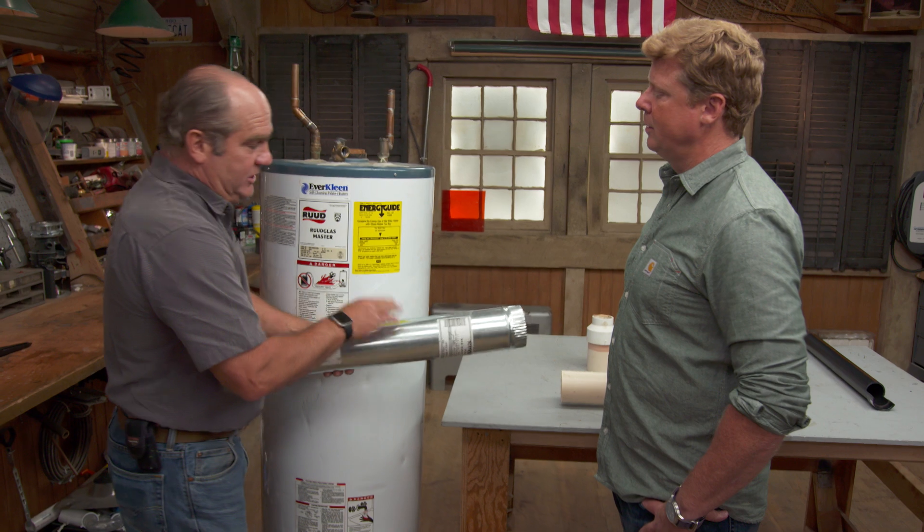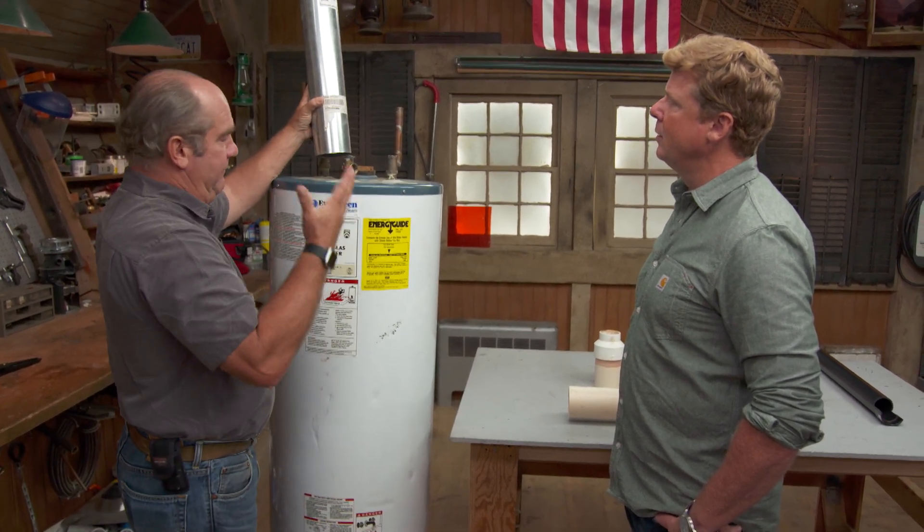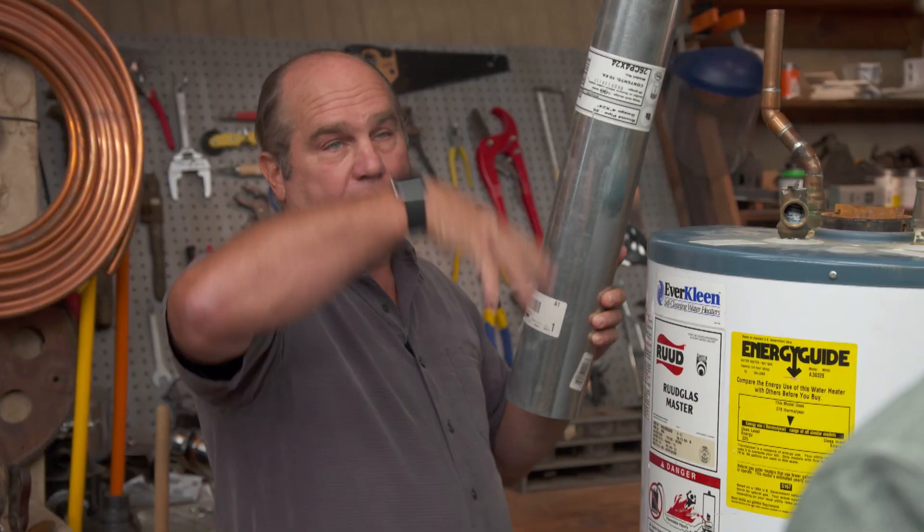It has a flame down below, has flue products that have to get outside the building. So it has temperature, has carbon monoxide, and usually has some moisture in it too. So historically we use this galvanized smoke pipe. It would come here, it would go into a chimney, and it had plenty of lift, right? Because it had a lot of heat. And it would go right up the chimney and right out to atmosphere through the top of the chimney.